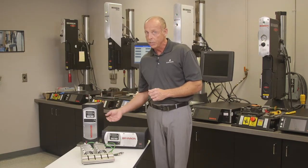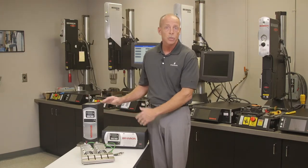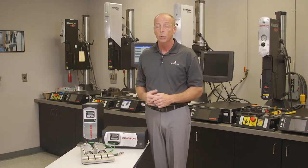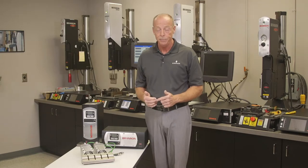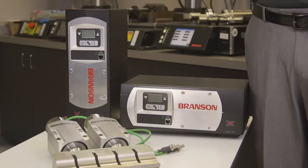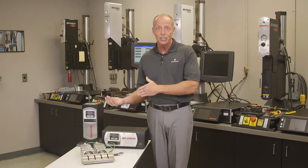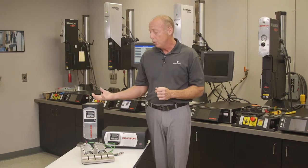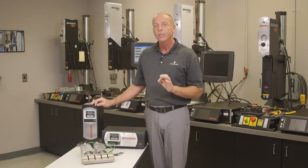They're in vertical or horizontal configurations. They're generally mounted in an electrical enclosure in a rack arrangement. It's not unusual to see 5, 10, 20 of these units in a high volume assembly system. They are communicating with the PLC. This is the machine controller. The signals and the start, stop, and the potential alarm generation is all provided by these units. So is key data acquisition.